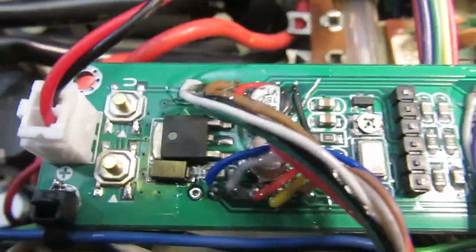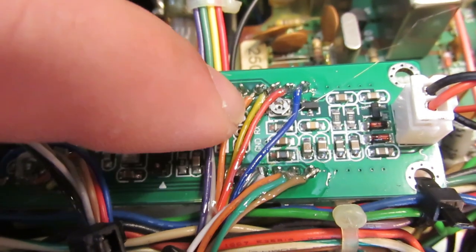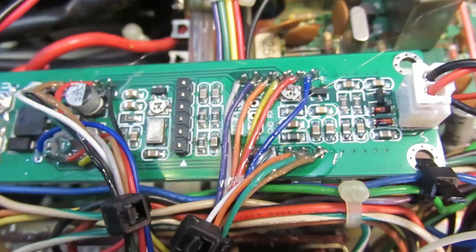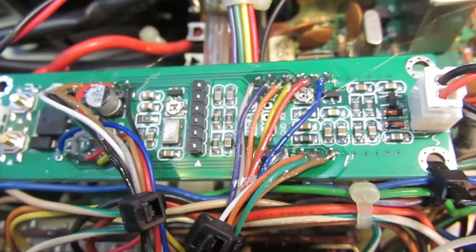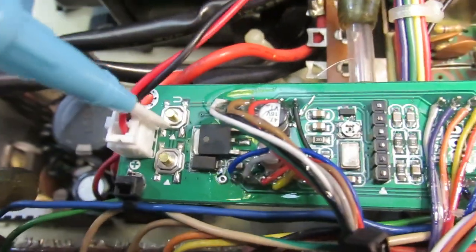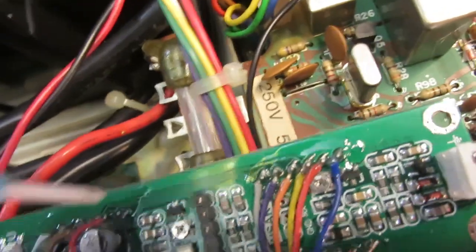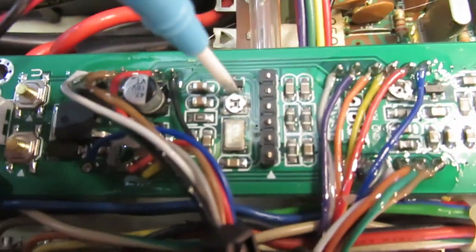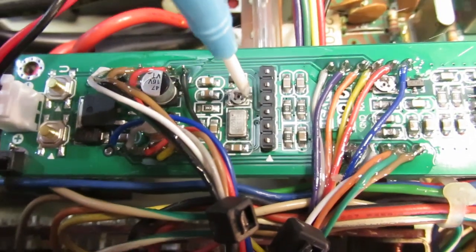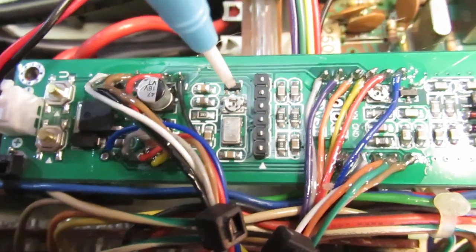And then after it's all done, what I do is I put some contact glue in here to make sure they all kind of stick down, a little more secure that way. But there's a few points here, you've got to be careful with the glue. A, you have to have access to these buttons. And B, this adjustment here is a display offset. So if it's off like a kc or two, you can adjust that and get it back on frequency.